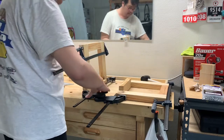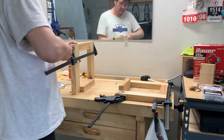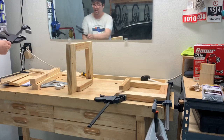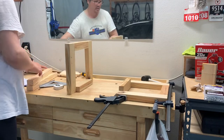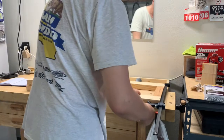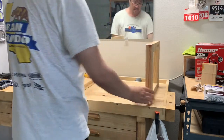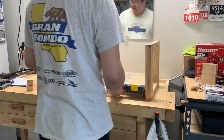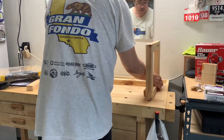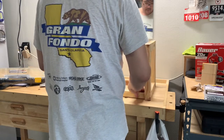Four storage bin cases make up about 11 inches of height, which allows me to easily place the rack in the lower shelf. I initially used the two-by-fours from the bottom of a pallet — though they're not actually two-by-fours, they have a forklift cutout slot so you have to rip cut them down to about an inch and three quarters by two inches. They're kind of uneven pieces, so I planed them down with a planer to make them a little cleaner.